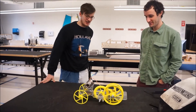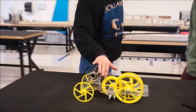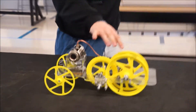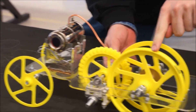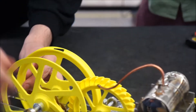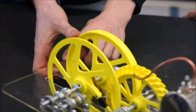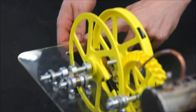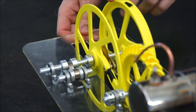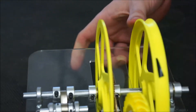This is our steam car. It works by charging a turbine which is connected by fishing line to a spool that winds back for about ten rotations or so, charging a constant torque spring. The driving wheel is connected to the same shaft by a ratchet so it doesn't move as it's being wound. But when the tension in the spring is released, it propels the car forward.